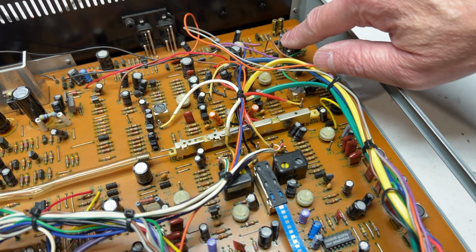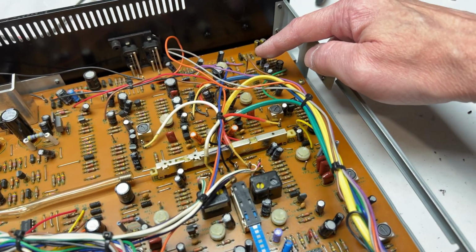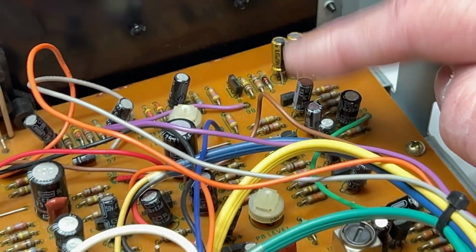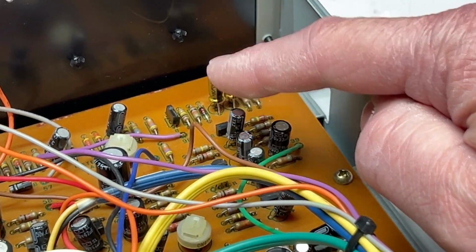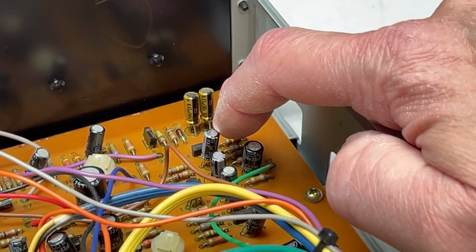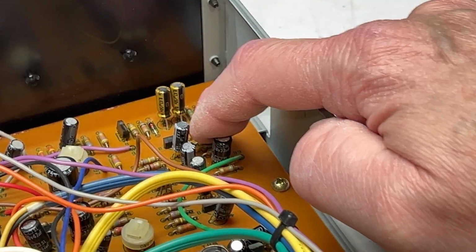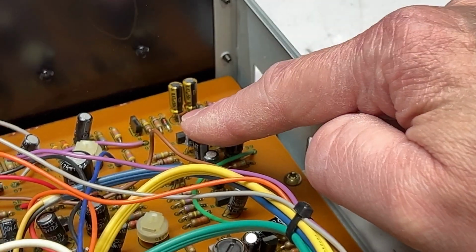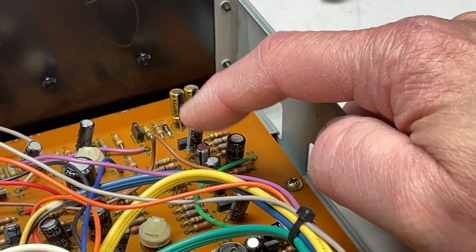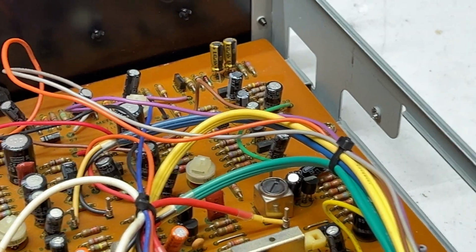We've got a couple of capacitors connected back to back in this circuit. This is one of them here. I changed that one first. Zoom you in first. The reason I changed that one first is because I was getting really inconsistent readings off there. The one side had no volts and the other side was just kind of jumping around on the meter. On the multimeter, that is. And I thought, well, there's only one part in between that and the audio signal, and that is this capacitor. So I changed it, and voila, we got a working meter.